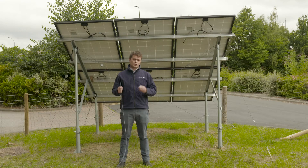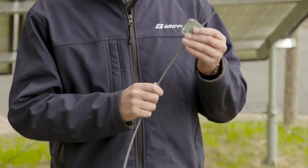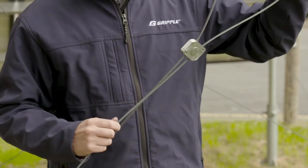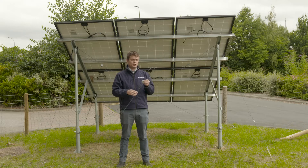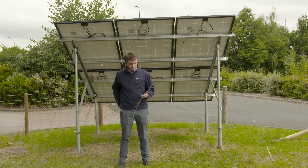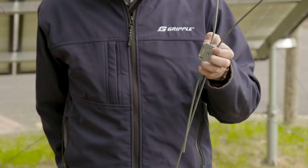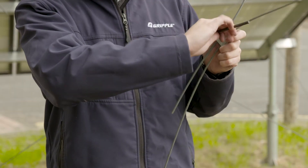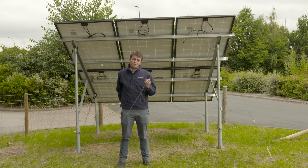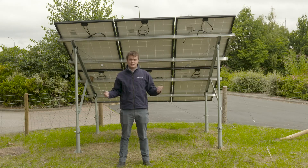Now we're back from watching the demonstration video, I'm just going to show you a little bit more close up to introduce you to the PV tensioner. Basically, wire rope can go in one way and move through a channel but can't come back the other, so it automatically locks in that channel. You can loop around and back in the other side and you've created a loop that's not going anywhere. You can continue to add tension in one direction so you've got a pre-tensioned brace across your structure. If you make mistakes, we have little release keys to back the wire out. These products are also lockable — an allen key system where you can turn a lock to lock it off against dynamic movement to prevent jacking. It's really fast and easy to install, looks decent, and you can apply or re-apply tension easily.